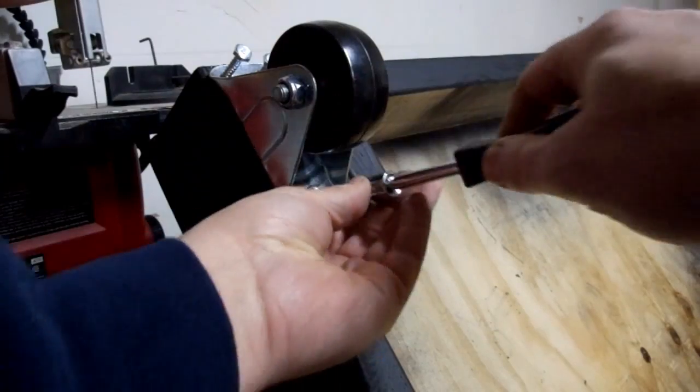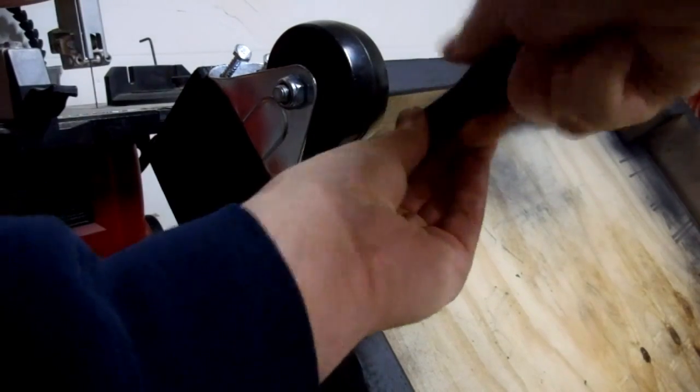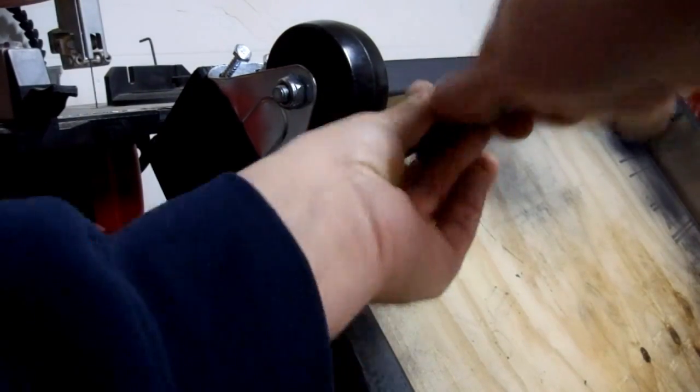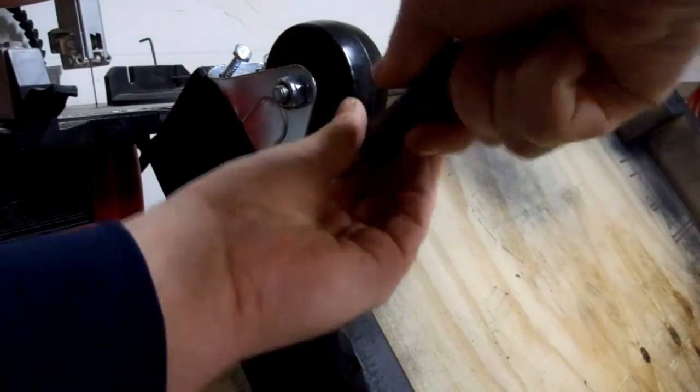It was found that it was too hard to steer with swivel casters on each corner, so I replaced the ones opposite the handle with fixed casters. I should have thought of this at the beginning, because when you go to the big box store, those flatbed carts have wheels on the handle end and fixed casters at the other.